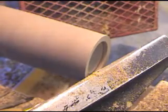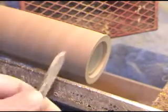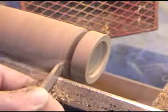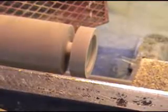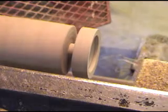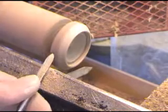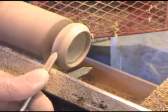Got that cleaned out. Now I'm going to go to the large parting tool because I need to make a taper to that tool. As you can see there, we went down and made a pretty good gap in there. Now we'll take our detail tool and we're going to roll the front over pretty much so we don't have a lot of rim there. Then we'll start rolling to the back.